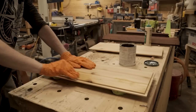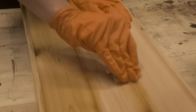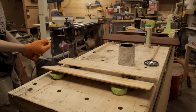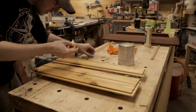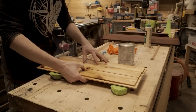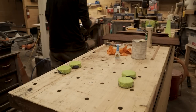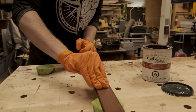There is one downside though. I didn't put enough glue into our middle section — quick moment of stress, but I quickly realized it's not that big of a deal. These panels are not meant to be structural and they're not carrying any weight. The way this panel broke, nothing actually broke — it's just that I didn't put enough glue on that middle piece and it didn't hold those seams together. So I just took a bead of super glue, put that in there, let it dry for a little while. Now that it's in the finished nightstand, there's absolutely no issues — the pieces are locked together and there's no way for them to come apart.